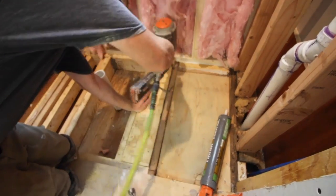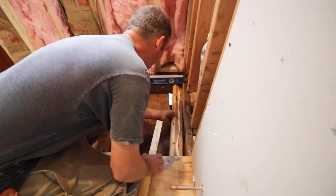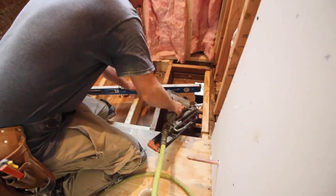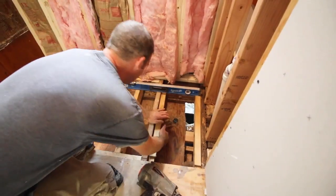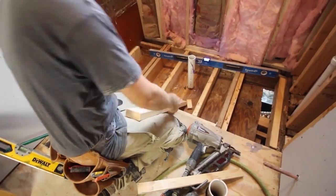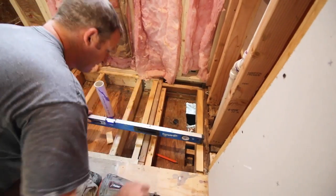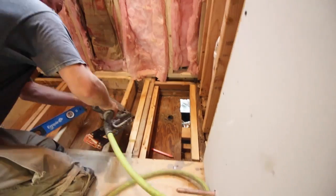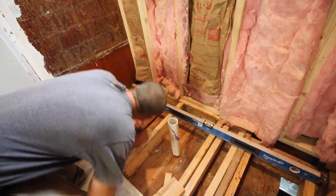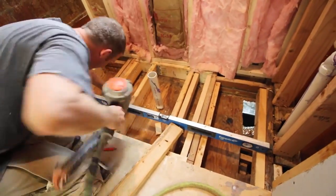Let's dive into the first segment. The first step is to make sure your joists are level — that's what Steve is doing. The next step is to bond a 2x4 three-quarters of an inch below the top of the joist, using a scrap piece of three-quarter-inch plywood. You want to use liquid nails between the 2x4s and your existing joists to help with bonding, then use 16-penny (3.5-inch) nails to secure those 2x4s to the joist.